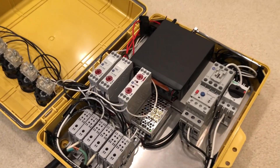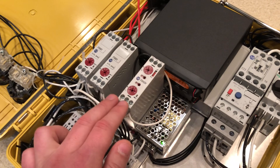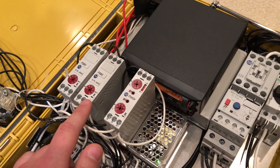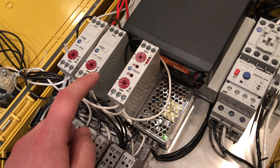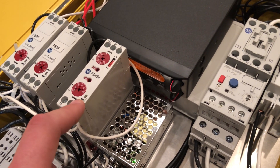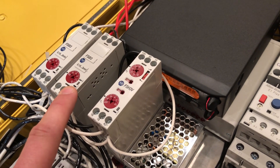For the attack circuit, these two work together. This is another three-minute off-delay electronic timing relay. This one is a flasher or repeat cycle timer. It provides constant power for three minutes, but instead of being connected directly to the contactor, it actually powers this repeat cycle timer. So while this is operating, it powers the repeat cycle timer which is connected to the contactor — starting with an eight-second on cycle followed by a four-second off cycle, alternating until the three-minute cycle ends, at which point the attack cycle is complete.